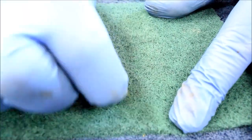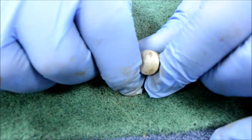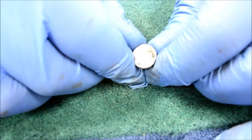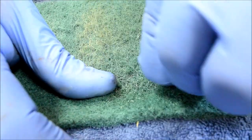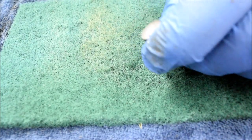What I'm doing here is rubbing the thumbscrew that holds that plate on against a piece of Scotch-Brite with a little bit of mineral spirits. Most of what has stained this looks to be old sewing oil. We're making some progress — this was pretty much black when I started. That's just another technique you can use.